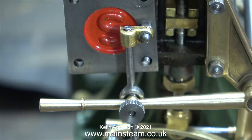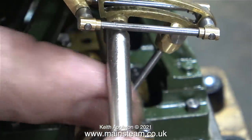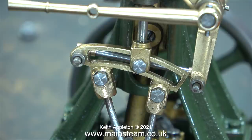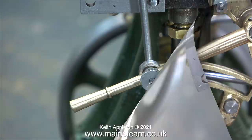In the design of this valve gear the locking bar is supposed to be hung from an extended stud on the bottom left-hand side of the steam chest. At first I couldn't figure out why it wasn't going together as it should. After a short phone call with Andy at Stuart Models, he said there were some problems with early issues of this valve gear and offered to send me another part, but I didn't need it — I prefer the way I've done it. I really don't like to see things hung from studs because it just looks like an afterthought. When the steam chest cover is refitted the correct way round, I think it looks alright. Here I'm showing why I removed the crossbar — my nut spinner just would not fit. With the crossbar removed reassembly is much easier, and after turning down the diameter of the end of my nut spinner the die block was refitted to the valve fork in no time.